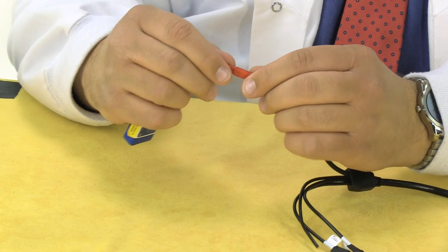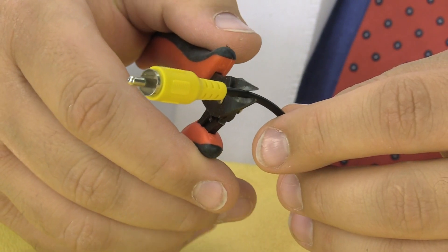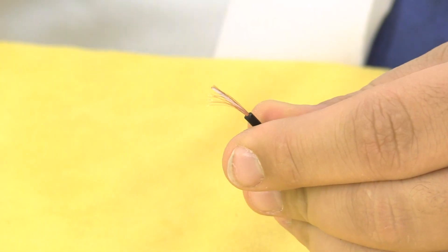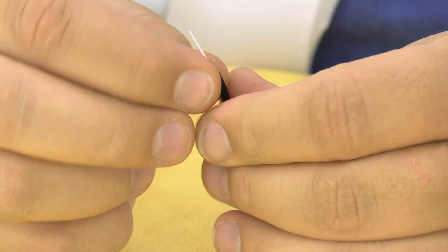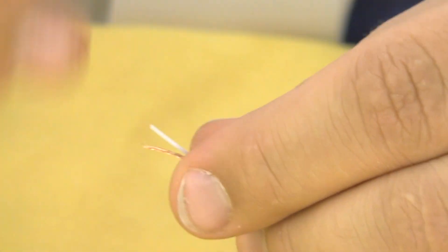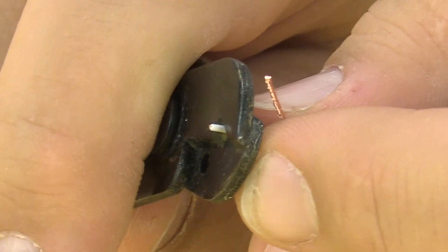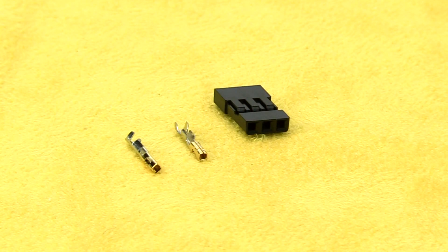Just quickly check and make sure it clicks in okay. Okay, that works. Now remove the RCA connector. Next, strip the video cable and mind the wires on the outside — you'll need those. We have the ground on the outside and the video wire in the middle. Since we're using the ground, let's just twist it together. I'm going to cut these to equal length, then strip the video wire and twist that up. We're attaching a male servo connector to the video wires.